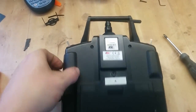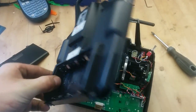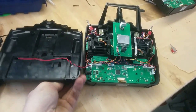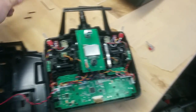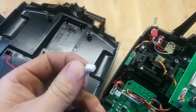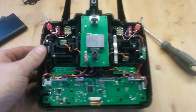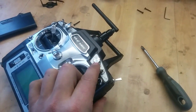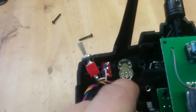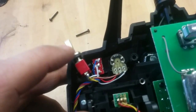When all are removed, let's see if you can pick this apart. When you turn this upper side down, if you have the screws loose, be aware that they will fall out in your hand. When working with this, I recommend to pull out the battery plug — this is marked, so it should not be any problem to put it back. Then you put the lid aside. Now you have the back side of this. We are going to utilize this knob here, through the three-button switch up in this corner. As you can see, there are three junctions here. This one has two, so we are going to remove this totally, and this one will not be used at all.